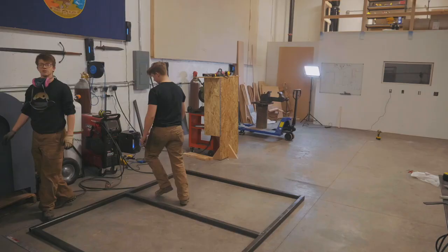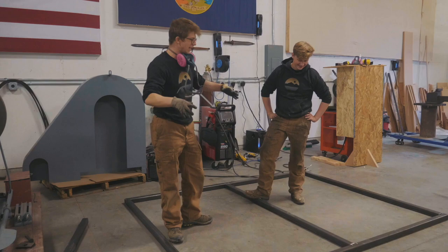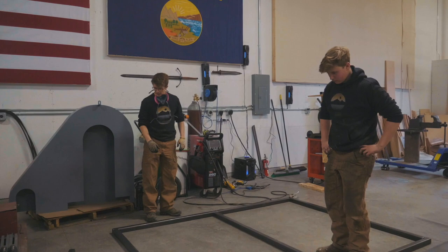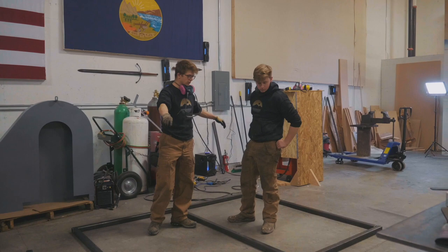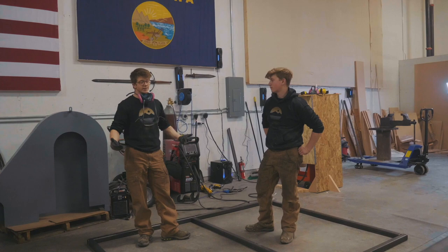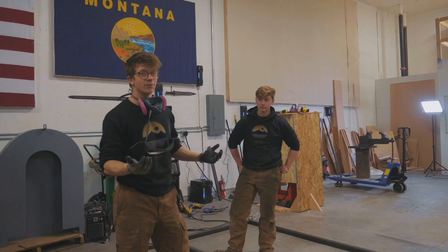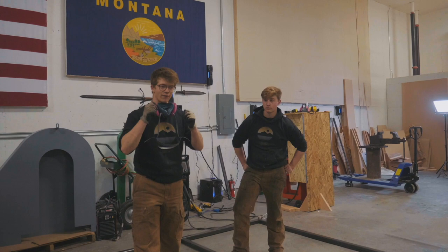So we have steel cut. We've got our pieces laid down on the ground for our main frame of our steel rack and we're ready to tack weld it up. I'm going to start in this corner with the welder, do the outside corners, tape it corner to corner, adjust if it's out of square, then put the middle piece in. We're going to weld it up, flip it over, weld it up, flip it over. If you've been watching the channel for a while, I made a steel rack at my old workshop — so this is steel rack Mark II. When I made that steel rack I'd recently done my first ever TIG welding, so I TIG welded the whole steel rack and it made it take forever. Right now we're fortunate to have some MIG courtesy of Lincoln Electric — we're going to MIG weld this sucker.